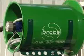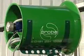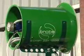The powerful fan is housed at the rear of the unit. This mesh is a flow straightener. It's been designed to remove the vortex effect from the fan and ensures that the spray from the atomiser reaches its optimum range. The atomiser, fan and flow straightener are housed in this sturdy cowl.